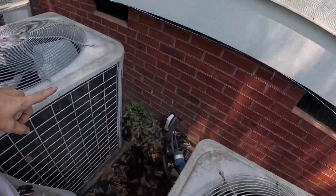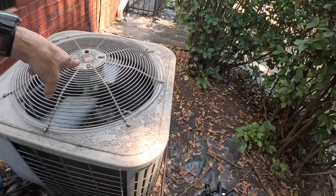Okay guys, on this call we have three systems. They are all three sweating back nice and cold suction, but this one is blowing out room temperature air. So I need to find the air handler and see if we have any heat strips stuck on.